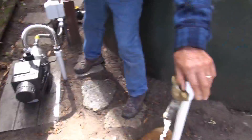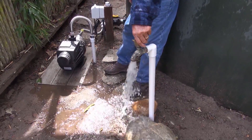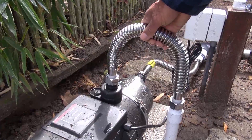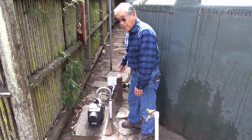The pump is off right now, but if I do that, it just kicked on. And is that rainwater coming out of there? Yes. The reason why we have flexible tubing is because if there's an earthquake or settling, it doesn't damage the pump or the tanks. Years and years ago, it was actually illegal to collect rainwater in Monterey County, which seems ridiculous, but that's true.